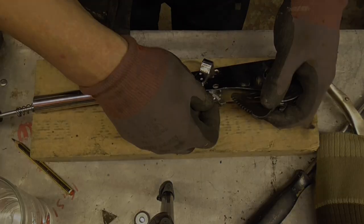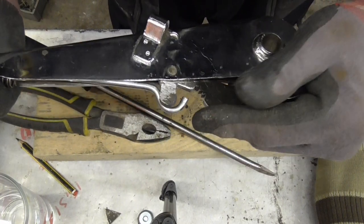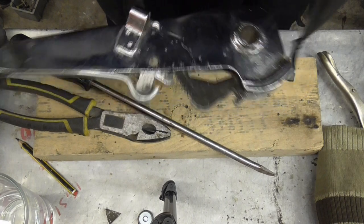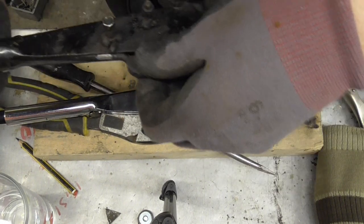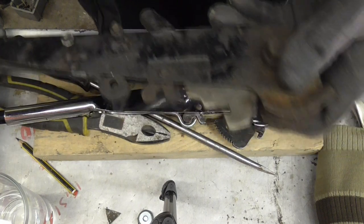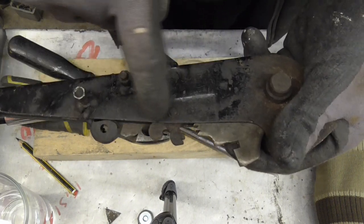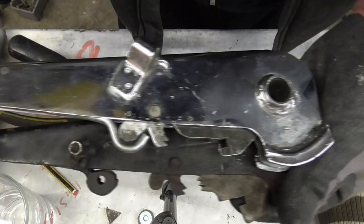There's one more thing we've got to do. So we're all back together again, looking quite nicely. It locks in place one way around — pressing down like you would on a handbrake — and then it releases. But you'll notice the hook jumps off the pawl. So the next stage is to create something to stop that from happening. On the prototype I used a couple of washers welded onto the hook to create kind of like a bucket which sits on the pawl. On Beefcake I did it slightly differently — I actually drilled through and attached it permanently so it didn't come off.